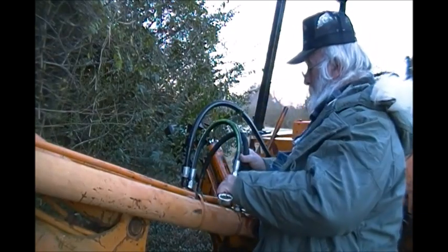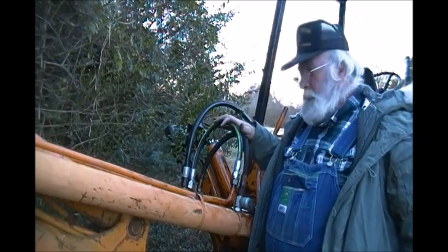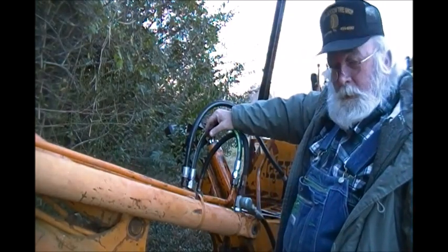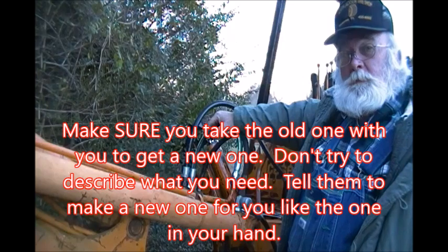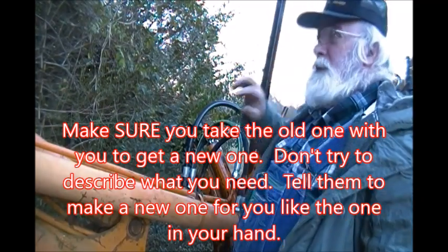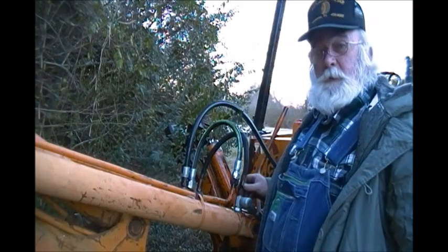Don't get hung up thinking you're going to repair your hose. Don't even think about that. What you need to do is just go ahead, bite the bullet, take your old hose in, get a new one made, and get it on there and you're done with it, because this is extremely high pressure. And there just ain't no way you're gonna be able to fix it properly. You just can't jerry-rig this. This is one thing you do need to have made up for you. And then it's done, and it'll probably last your lifetime. I know it'll last mine. I got this one right here, same age as the one that popped, but I'll replace them as they go.